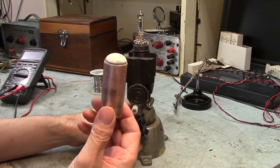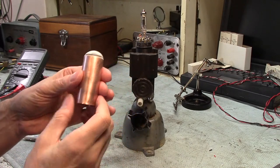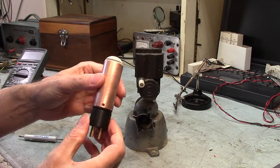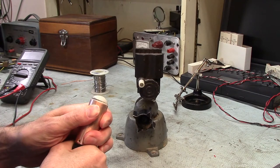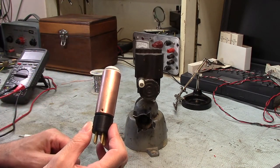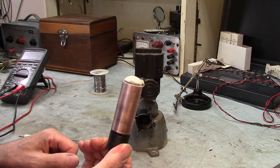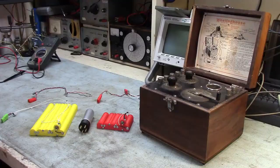Next on the project, I have the copper tube with its little dome in place, sanded with Bondo. The assembly is designed to come apart with a screw — the 3D-printed part is pretty tight so I probably wouldn't even need it, but in case the socket on the radio is tight I want to be able to pull the tube out without accidentally pulling the copper tube off. So the next thing is to mask this off so the base stays black while I silver-paint the tube to make it look like a silvered glass envelope of a later WD-11, or at least suggest a vacuum tube from a passing glance.